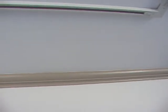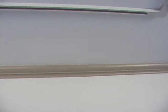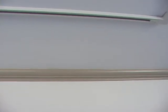you can see the red's right there, it's hanging out of the ceiling, is due to my error. And the error, they think, is that when I was working over here, I found a wire that was exposed, and it was connected, it had a connection, and it was not properly secured in an electrical box. We all looked at it. Now, the thing that got me was it was just sitting there in the ceiling without a grounded box around it. And what I did is I installed a junction box there.